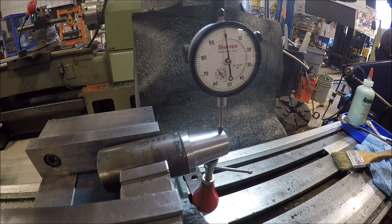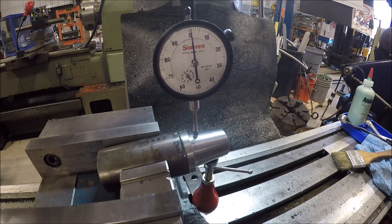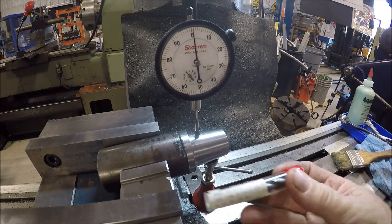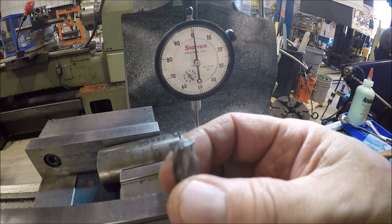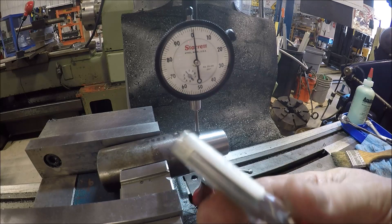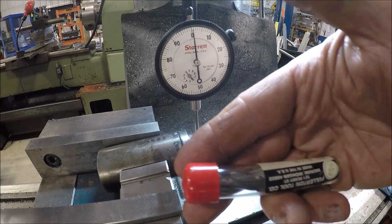We are set up over here at the Accelo mill to cut a slot for that broach to ride in. I got her dialed in — I think that's pretty darn good just to cut a slot for a broach. I don't have a 10mm end mill — that's basically the thickness of that broach — but I do have a 0.3906, a four-flute carbide end mill, which is close enough to 10mm. Thank you Rick — you gave me a whole bunch of end mills from your work when you guys closed up, and I still appreciate them. I use them when I can.